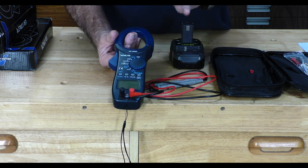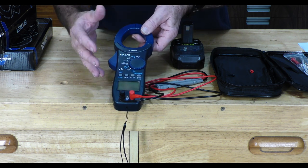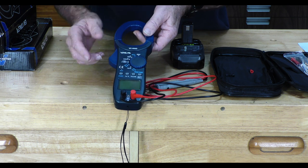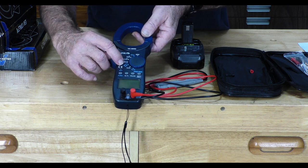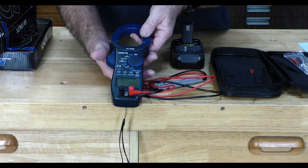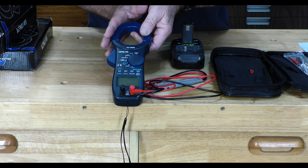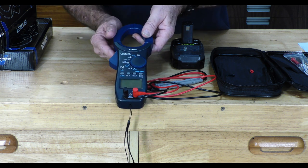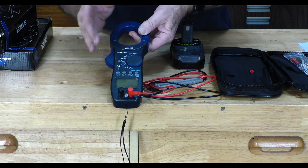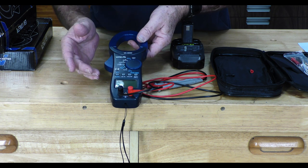It's a terrific multimeter with a beautiful digital output. We'll have a link hopefully with a nice discount. It has more features than most do-it-yourself folks will ever need, but that's great. You can measure diodes, continuity, and resistance — so it's an ohmmeter, a voltmeter, an amp meter. It also has this NCV induction sensor on the front for sensing an AC wave in a cable. We also have true RMS which can be measured.